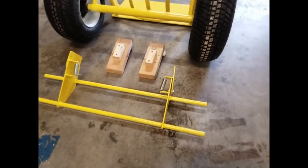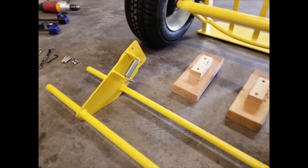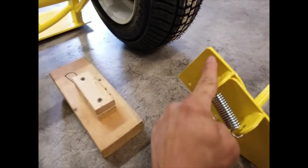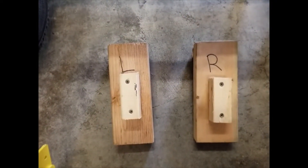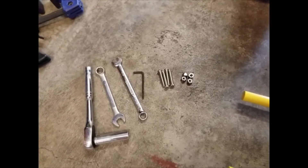Here is the assembled foot brake. You want to lay it behind the dolly, springs up, resting on the beveled edge. Your mounting brackets with the holes should be facing forward. Here are the spacers that you should have received in your package — left and right. You should make sure that you have four mounting bolts and four lock nuts.